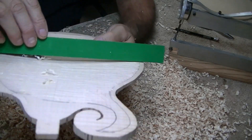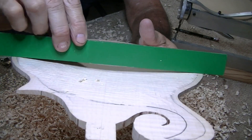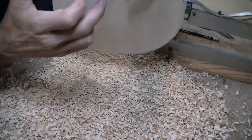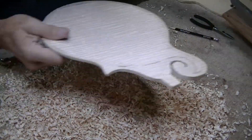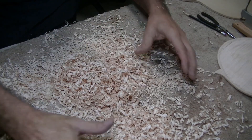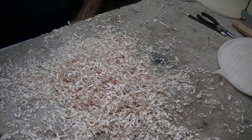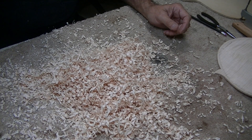I've got the inside carved — I would say about two-thirds of the way there. It's still got quite a bit to go, but it's lightened up a lot and it's starting to have a tone, but not much yet. This is where that new shop improvement comes in handy — there's just far too much dust for a little Dustbuster type deal, and it's too big a hassle to bring in the big shop vac. I did put the router speed controller on my new hoist for the vacuum and it moves much slower now — just about the right speed.